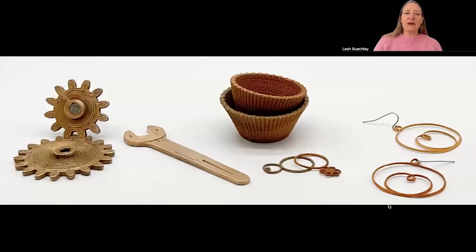Serra Metal is both a material and a process that we have developed in our lab. Serra Metal is a custom metal clay that we've developed that we can 3D print using off-the-shelf ceramic clay 3D printers. Once we've printed an object from our metal clay, we fire it in a kiln where it is sintered into a solid metal part.